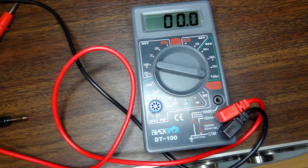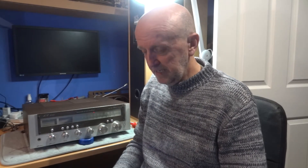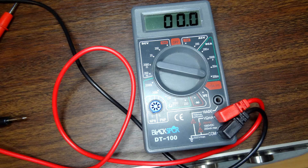I'm just going to show you a quick picture of the meter I'm using. It's not very expensive - about nine or ten pounds or dollars - but it's going to be fine for what we're using. I'm going to use two meters in the video just to show them side by side, but you only need one because you can do each channel separately. The setting we're going to turn the dial to is DC amps, set to 200 milliamps. We're looking for a range of about 20 milliamps, there is a 20mA setting but we go one step further to give us a bit of leeway.